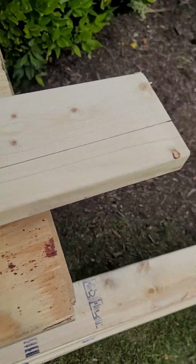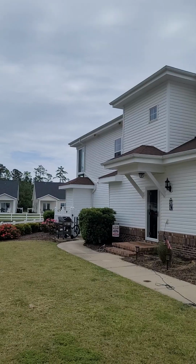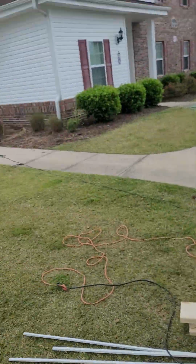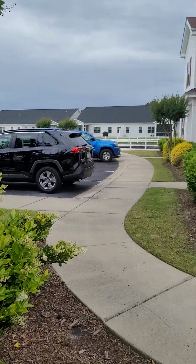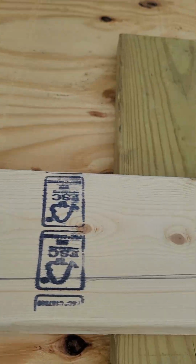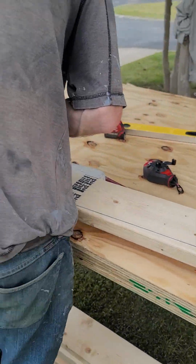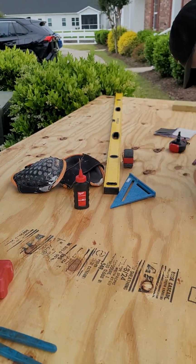So, we're leveling a floor. That deck up there in the top floor, that was just added, guys. And he wants us to make it level. Right now, it's all tapered away from the building. All these decks point down at the back so the water can run off, out and away. So, we're going to make up that difference with this, plus the difference in the height of our plywood, which is pretty thick ply. See that, guys? So we're going to install these and lay that plywood over it. And that's going to be our level.